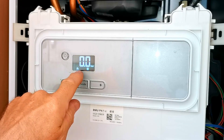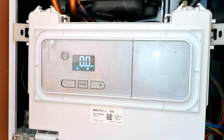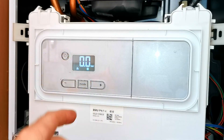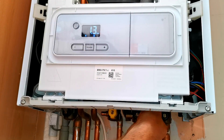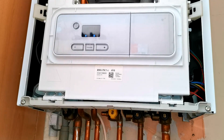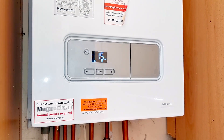I've now replaced the pressure sensor and you can see straight away the display is showing zero — so the boiler will not operate until we raise the pressure inside. That's the old pressure sensor there. Now I'm going to go to the two valves underneath and raise the pressure up to around 1 to 1.5 bar. The pump will start running whilst I'm doing this and will fluctuate the pressure a little. There we go — we can see the pressure is now going up.